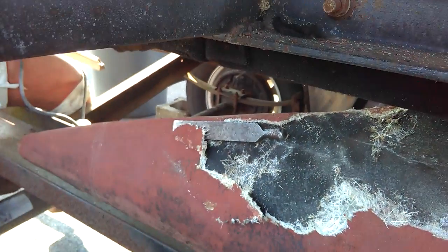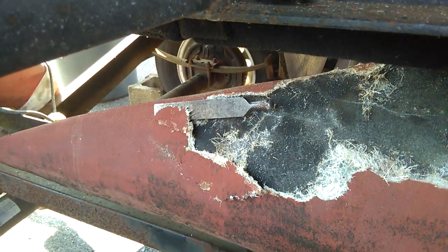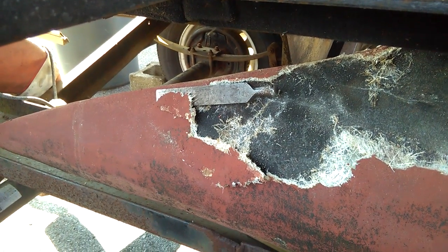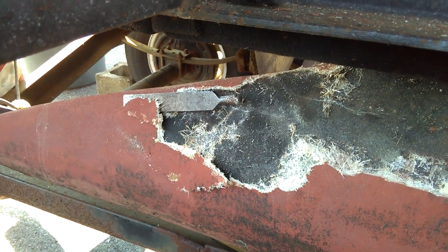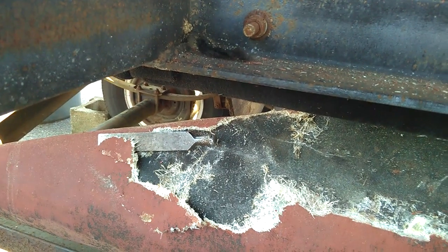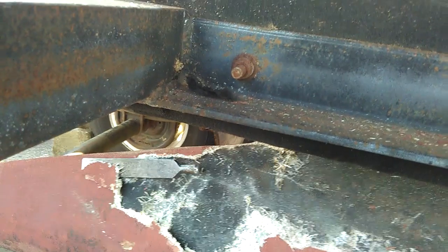That's what you do the whole way — it's very time-consuming but necessary. You just work your way under the old stuff, and then once I get this all stripped down, we're going to grind everything clean, sand what we have to, and prime the cast iron metal until we get the rest of the hull painted. That's what we're doing today, thanks.